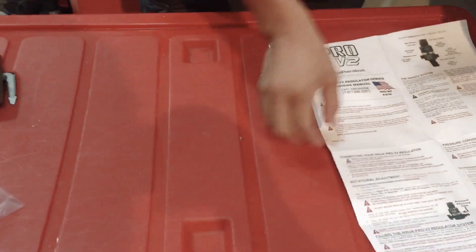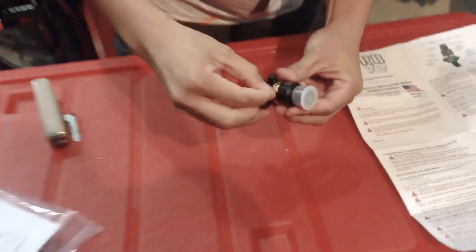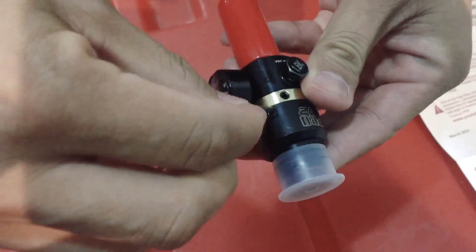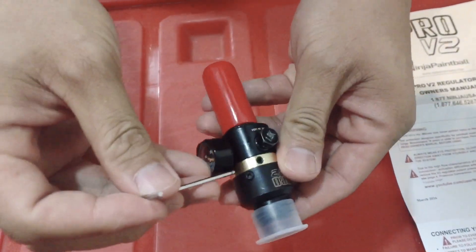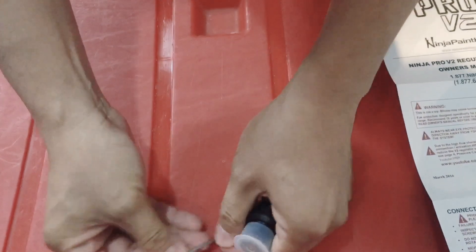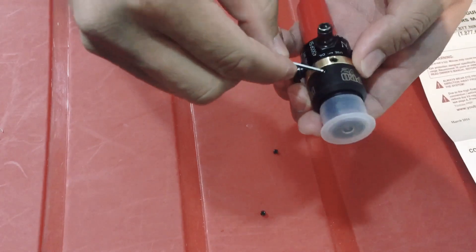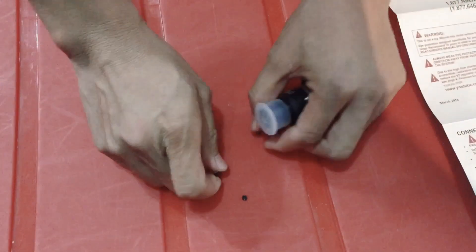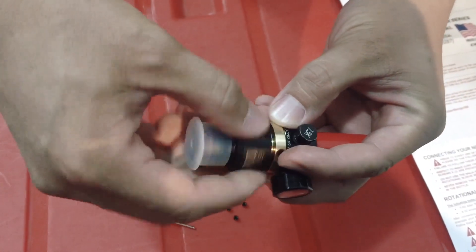And this is the way you remove the shims. What you do is, of course, I have my very reliable tool kit here. I'm not going to use everything in there — just one allen key, which is actually not supposed to be in here. That's all you need. Just zoom in and show everyone. All you need to do is simply remove these little nuts over here — three of them. And you'll notice that the top portion of the regulator can be easily turned out.